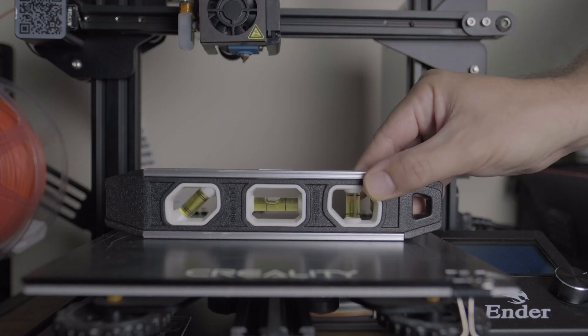But I figured, why not manually level it anyway, just to see. So on my next print, those thin and thick spots switched around — they weren't consistent. Now I'm no 3D printing wizard, but I do know how to level a bed. So something else had to be wrong. That led me to believe that there was something wrong with the hot end leading to these inconsistent prints.